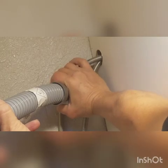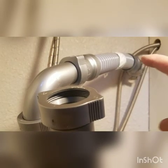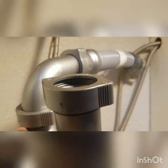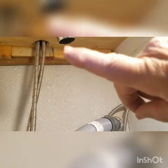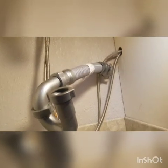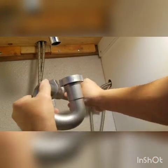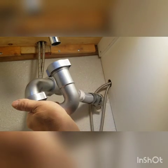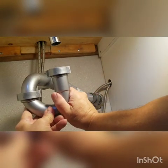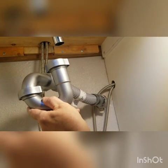Now I'm going to show you something. What makes this so nice is the flexible tube. Let's look at the drain down pipe coming from the sink — it's set back here and the drain's here, a little ways from the actual drain pipe above. This is flexible — I can turn this, get it adjusted, and if I need to come up, this will flex and connect right to where I need it.